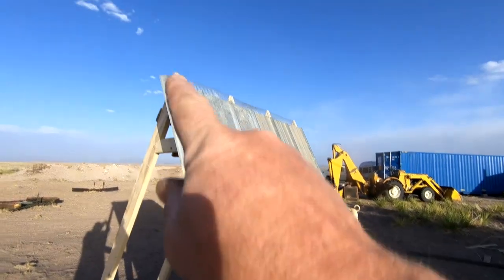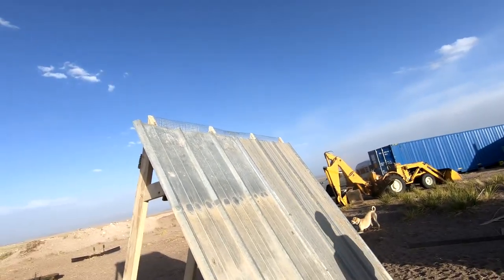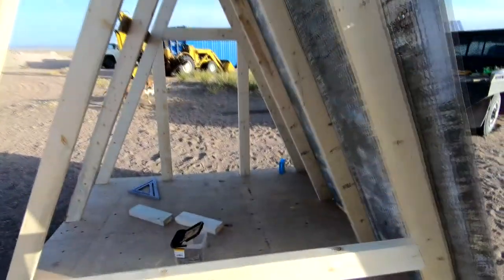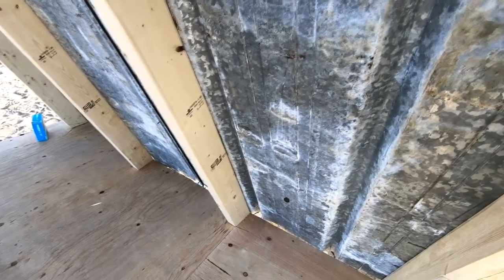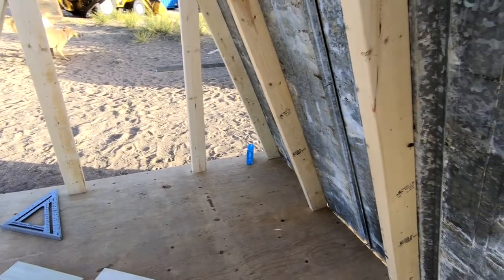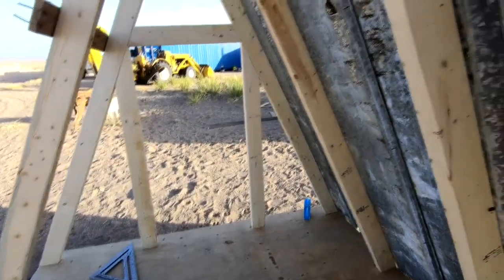And then ventilation up there that we've got secured with hardware cloth. Not that I think a raccoon would be able to climb this metal and get in there, but who knows. And then we can get airflow down through these gaps as well. That'll get us airflow ventilation. The important part with a coop is that you make sure that cold air is not blowing on to the chickens while they're roosting. So if you're getting convection that starts down there and comes up the roof and vents out the top, that's usually okay.